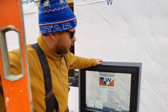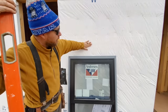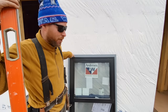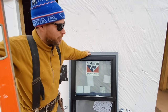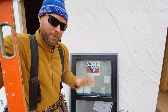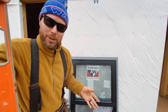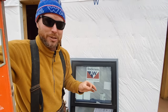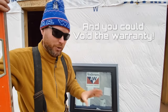Let's look at this window. It's got a flange that mounts on the outside of the wall sheeting, and it's got nail holes in it. We put a nail in every single hole and that will hold it tight to the house and keep it from coming out. I'm going to tell you a few things that I think every window manufacturer will tell you for every single kind of window. If you're going to put in some windows, do read the specific manual for that window because things do vary a little. But we're going to go over some things that pretty much any new construction window - you're going to want to do to get it done right.